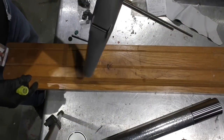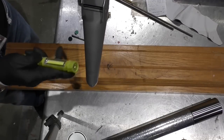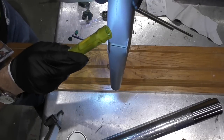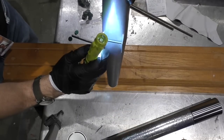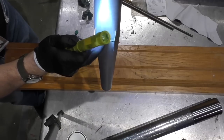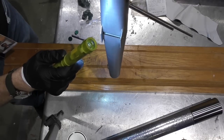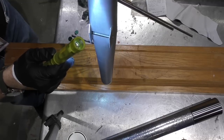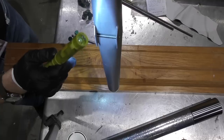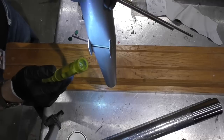One of the voicing parameters, which I have not yet duplicated, is what's called nicking. And I'm going to get the flashlight here. If you look, you can see little ridges on the lower lip and some on the outer lip, those little notches, which are called nicks, and they stabilize the speech. And in the 50s and 60s, even 70s, it was very fashionable to leave them out to try to create more chiff and transient noise when the pipe came on speech, but we're not after that.